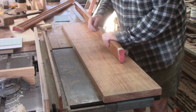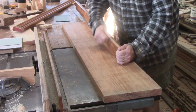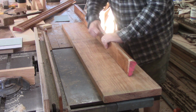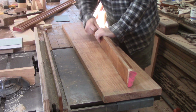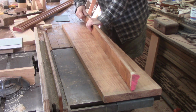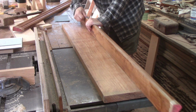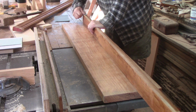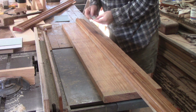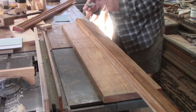So, you know how sanding goes, you sequence, right? Do one surface all the way, then do the next surface, rather than a little of this and a little of that. Now, what happens, I'm sure you know the drill here, you have a tendency to use the sandpaper up, so to speak, in that one spot. But it's better than chasing all the pieces, because you get lost otherwise.